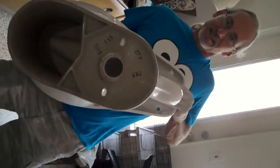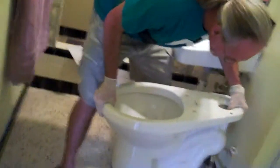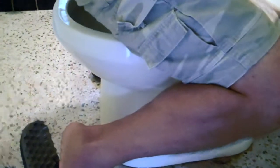Now we put the toilet on. This is our bowl — we're going to go ahead and put that thing in there. That's going to set right on the wax donut. We've got to match up these little bolts that go right through there. Got that one, and that one. Now we're going to smush it down, put some pressure on there. We've got our bowl set in there.